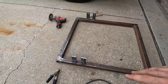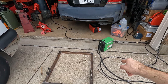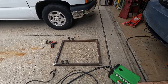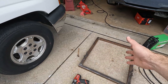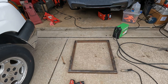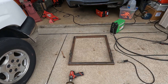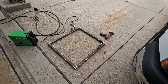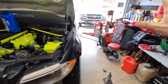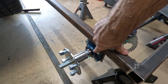All right, axle bars are mounted and good. I'm using the titanium flux core welder — that is the best flux core welder in my opinion and you can build anything with it. Hopefully everything's square — I did measure twice. I'm going to take the flap disc and clean some of the boogers off, then start on making the motor plate. I have a thick piece of steel but I need to slot it — I might use the plasma cutter to make that job easy. I'm going to put the axle on, test-fit it to make sure everything's okay, then flip it back over and start doing the engine stuff.